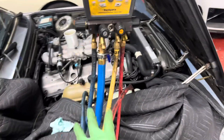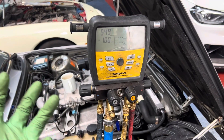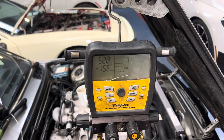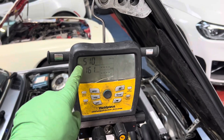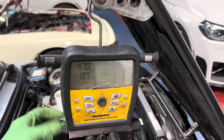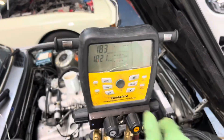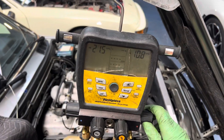We're going to do that again. Look — we're almost in the 500s now. See how much faster that goes? Once you get down from a laminar flow, volume mass flow of air or nitrogen in the system, or refrigerant, it's really hard to pull out. But then I swept the system with nitrogen and it got that moisture out of there, and now it came down real fast to the 500s. Let's repeat that.